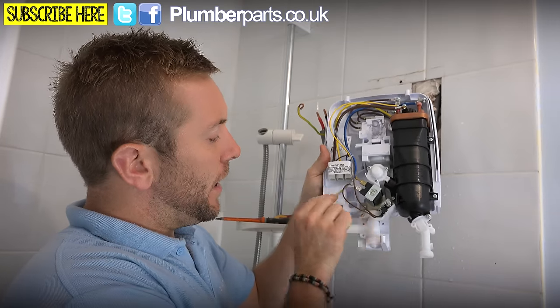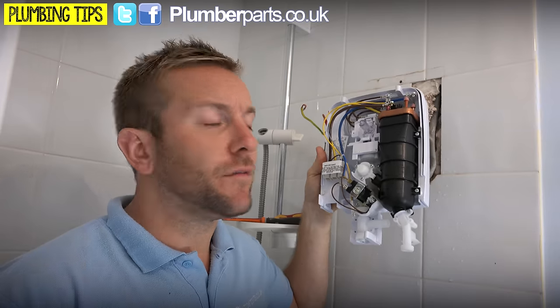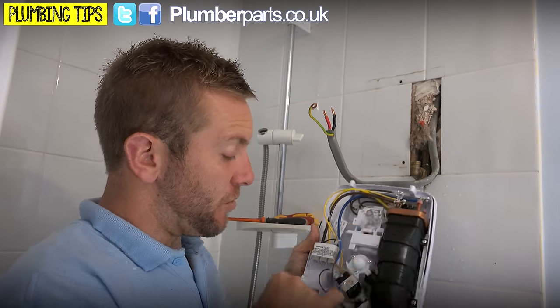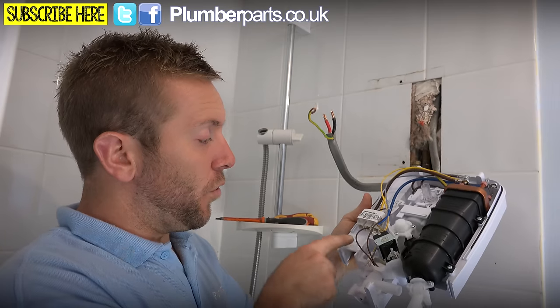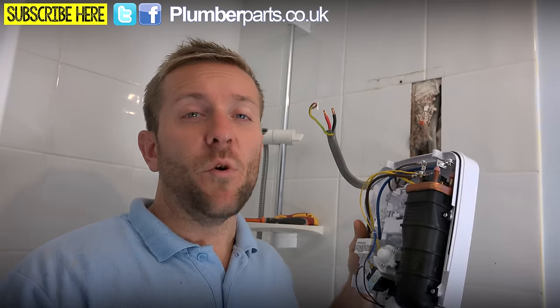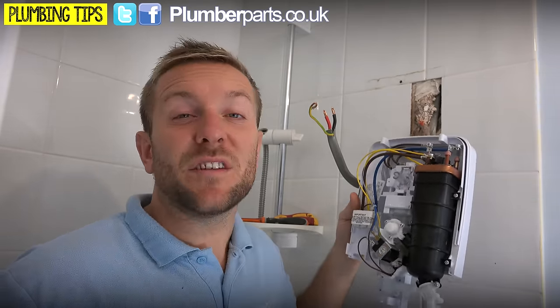Now, they make it so you can pretty much have multi-direction inlets for the water, which is really handy. So all we're going to need to do on this one here is swing this 90 degree elbow round and then get a nut and olive to go on there, and that should be fine. The same goes for the electrics, that easily go in. You're going to find this with a lot of different manufacturers. They're trying to make it as universal as possible so that when you change over to a new electric shower, you don't have to worry so much about getting the same manufacturer.